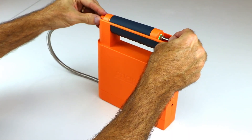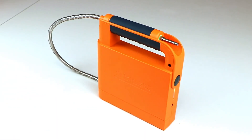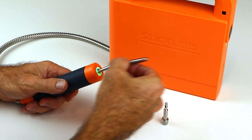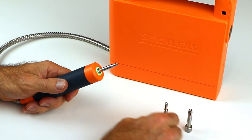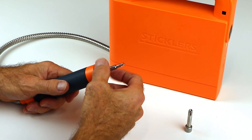Make sure the metal protective hose jacket has enough play and avoid a tightly bent radius. The included 1.25 mm and 2.5 mm cleaning tips are easily changed. Hand tighten them over the metal spray nozzle until just snug.